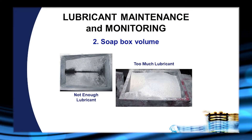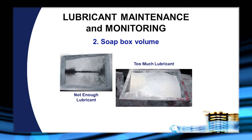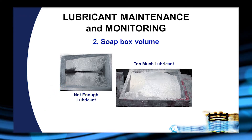Without this rotation, we can develop a situation called tunneling, in which the area around the wire has been vacated of lubricant. Now you're not pulling any lubricant into the die, and you wind up with lack of lubrication and increased die wear. If operators are not observant, the lubricant can get completely depleted from the lubricant box, leaving an empty box and again a lack of lubrication.